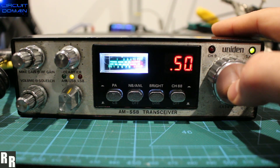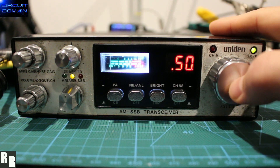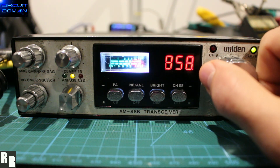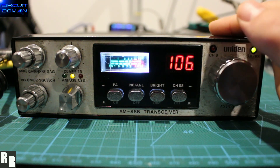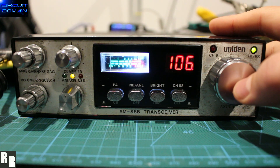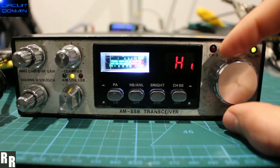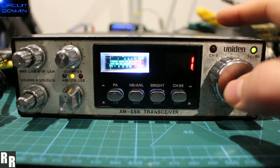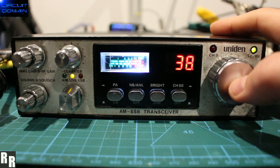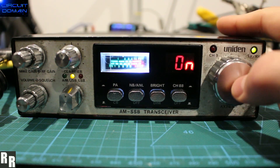For setting up the kit itself, make sure squelch is definitely up because we need that for auto-detect for your lock detect and channel range. Five button presses to enter setup. Select PLL — for the 8719s, PLL02As, UPD858s, and any radio with my RR PLL adapter board, you always choose 106 because that's the MC145106 that I use. Encode for this particular radio is 91. Squelch is always active high in these radios. Home channel — let's choose 38 this time. Lock detect: select on and let it scroll away.